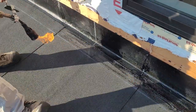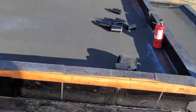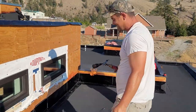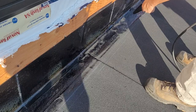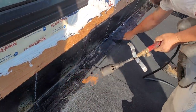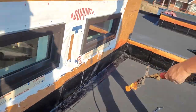That's it in a nutshell. You go back and look at your work. Watch yourself Cade — there's a bee, get out of the way. I don't promote killing anything, but sometimes the bee's gotta die. So I go back here, this should still be pretty warm — give it a quick heat. You notice I heat up my trowel at the same time I'm heating up the membrane.